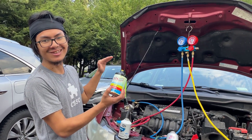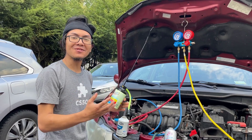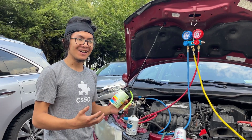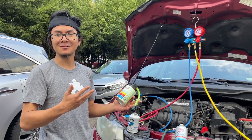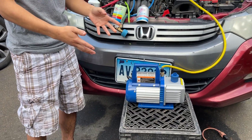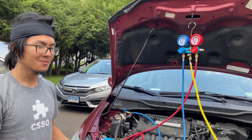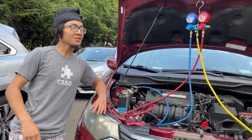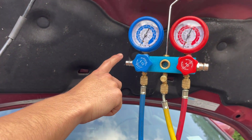The way we found out was he came to our house about his AC and said he'd put refrigerant in twice and it didn't work. The first thing we did was hook up the vacuum system — and lo and behold, it wasn't holding pressure. In his case, there was a leak on the high pressure side, but in our case it seems there's a leak on the low pressure side.